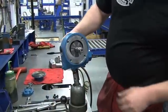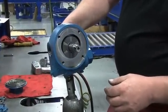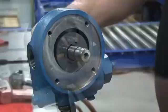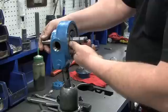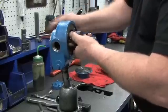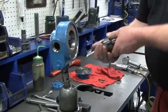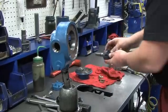Turn the pump around. On this side of the pump, you can see the rotor turn with the shaft as the shaft is turned. Installed in the rotor are six directional vanes. These vanes are loose inside the rotor assembly. Gently pull the rotor and shaft from the cylinder. As one hand is pulling the shaft, the other hand should be cupped underneath the rotor to prevent the vanes from falling out. Set the rotor, shaft, and vanes to the side.